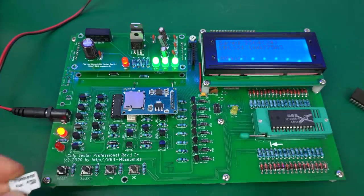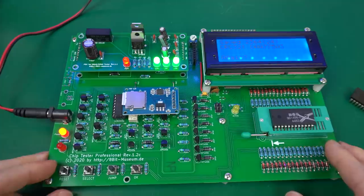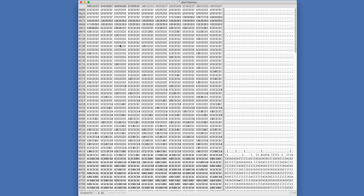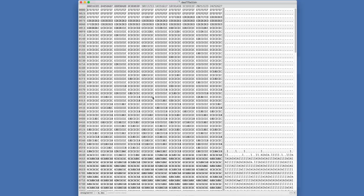But since I like knowing exactly what's going on, let's actually download the data. That way we'll see — is it just a byte that is off, or is it just completely wrong? Now it's saving it to the SD card. Let's open up the data that we just read from the ROM. Yeah, that looks like total garbage. There are just some bit patterns repeated. It's not just that it's missing a byte or two, which makes sense — because if you remember, we only needed a few bytes to be correct in this ROM to launch into the cartridge diagnostics ROM. We pretty much needed the address of the routine and then a very short routine that looks for some bytes. So yes, this ROM is totally gone.